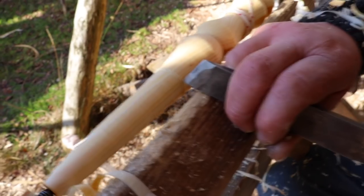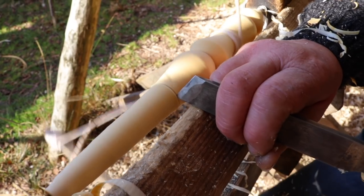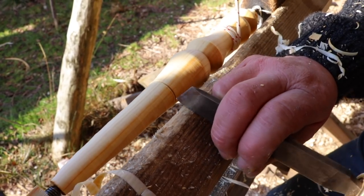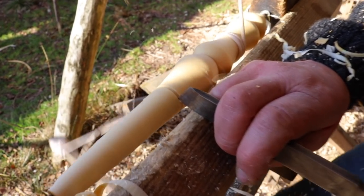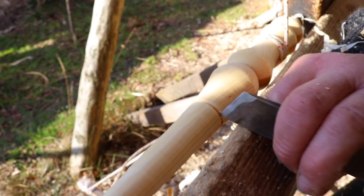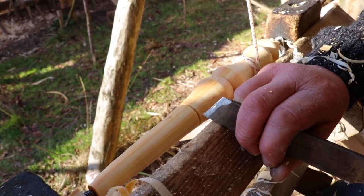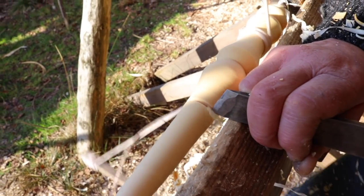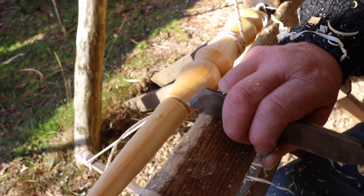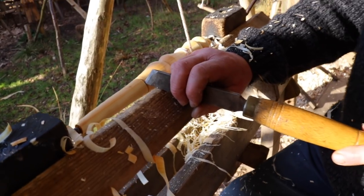So I'm going to move my tip just to one side and just take a little cut off and then take it down. And that widens the groove. I'm going to angle it the opposite way. I'm going to take a little cut. Can you see that little cut there? Start bringing it down. I'm going to do the same that way, and then we have a nice big groove there. You could widen it, just come to the end and take another cut off. Notice I'm not taking the chisel down in one go. I'm taking three or four pushes up and down with my foot to get down to the bottom of that groove. Let's put another couple of grooves in there just so you can see.